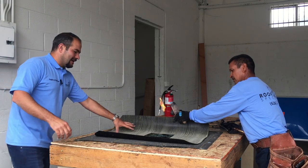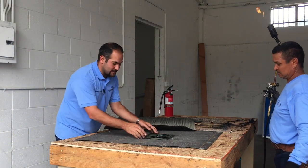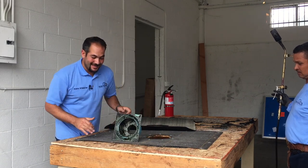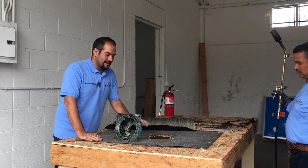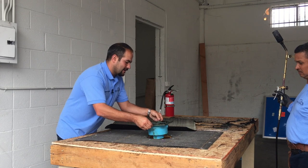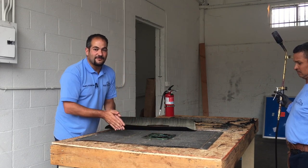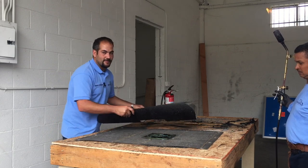So what we have here, we have a demonstration built up already. We've got the strainer drain — this is what we just dropped in place, it's a little bit hot. It's a cast iron drain. We've already got our glass base installed. The glass base is nailed down. You can take a look at our video later on how to nail that down. But the glass base is just for fireproofing and not for waterproofing, so we don't rely on the glass base and we don't consider it a waterproofing membrane.